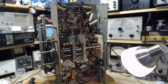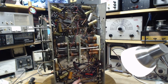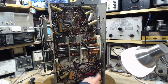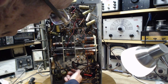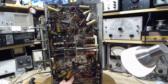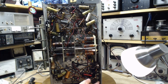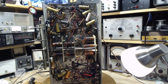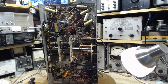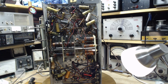Definitely a strange arrangement here. Wires coming out of the transformer. These must be going to the transformer, and they get their power. One will get its power from here. The other one's going to go up to the switch and come back from the switch, and there it goes in. So the fuse has to be in there. You have to have a fuse between here to get power to the transformer. So this is the transformer fuse. 30 amps. Well, we're going to fix that. Put the right size fuse in, because that's not going to protect anything. That wouldn't protect anything in my house.